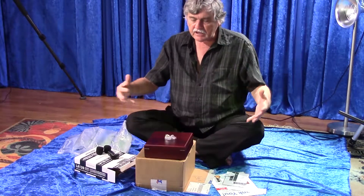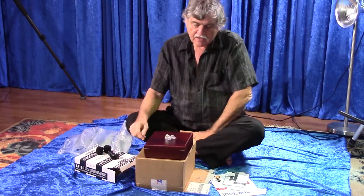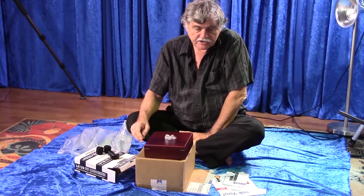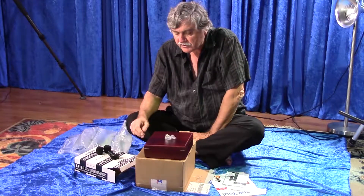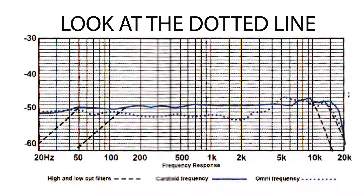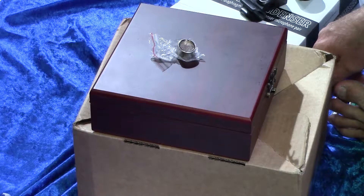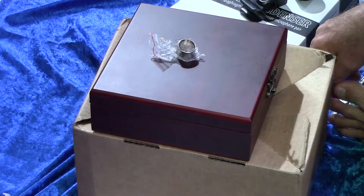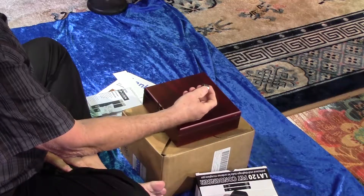With a diffuse field application, sound is coming from every direction. But when you test microphones, the tendency is to put them in an anechoic chamber, and an anechoic chamber has no diffuse field — it's all a direct field. When you do this, one of the things that shows up is that there is an exaggeration in the treble. So yeah, they know what they were doing. If you see this exaggerated treble, you'll know that's what it's for. Now if you want to use this omni in something other than a diffuse field application, I don't know how it would sound — you probably might do okay with just a little equalization. But definitely for room micing, it should give you a pretty good sound. So this is the omni capsule.